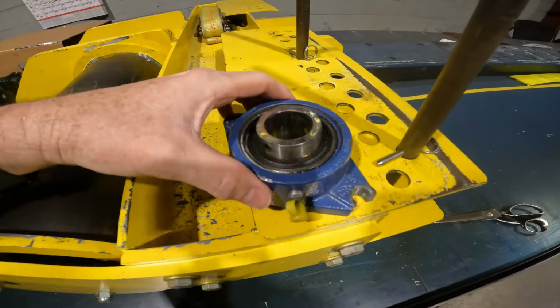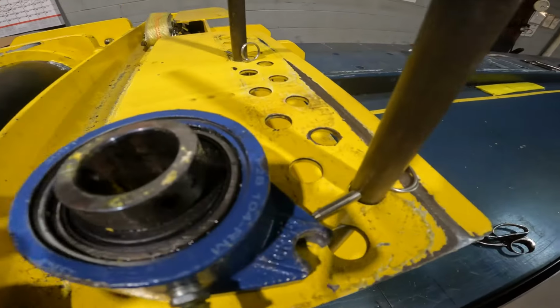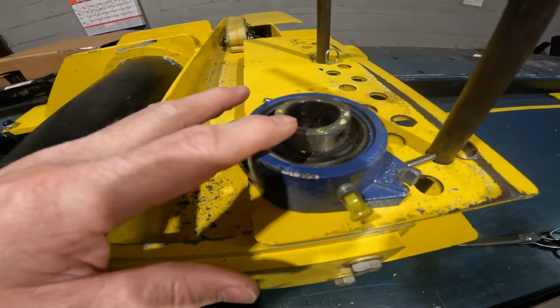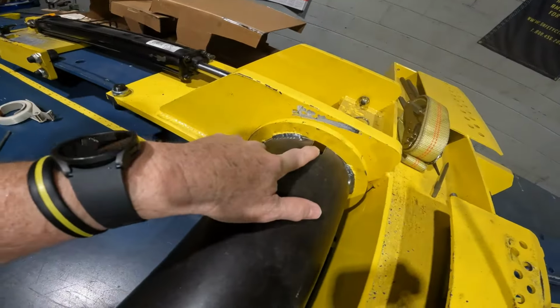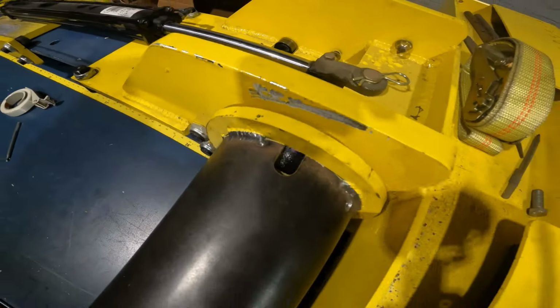This dead gone thing, if you'll notice, there's some set screws right there, one right there. Well, sometime over the years, or it could have done it when it broke, I don't know, those set screws spun on that shaft. And right here's some little slots that you can get in to adjust those.